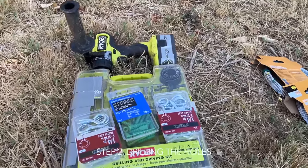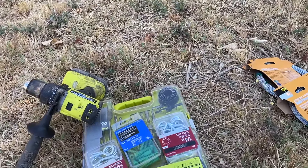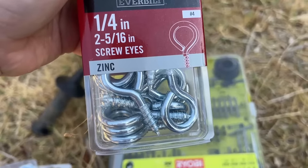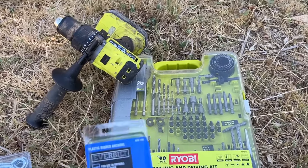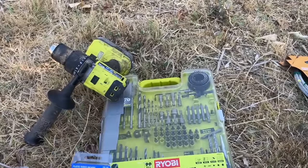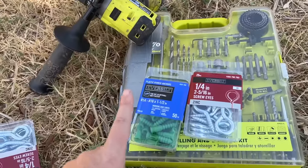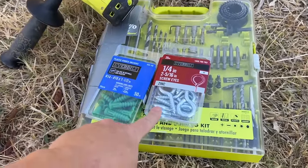Step two is drilling, and this probably takes the longest. You have to have a drill. I'm doing stucco, and this would be kind of the same but a little different if you were doing wood. You have to have a drill and a drill bit and you want to drill a pilot hole. If you're doing wood you just drill the pilot hole the size you need for the eye hooks. These eye hooks are a little bit shorter than I wanted but it's fine, they'll work. Because I'm using stucco, I have to use an anchor. There's not going to be too much weight hanging on these, so I'm not worried at all. All I'm going to do is at every spot I've marked, drill a hole with a masonry bit, stick one of these anchors in, and then screw the eye hook in by hand — and use a screwdriver to help so I don't get blisters.